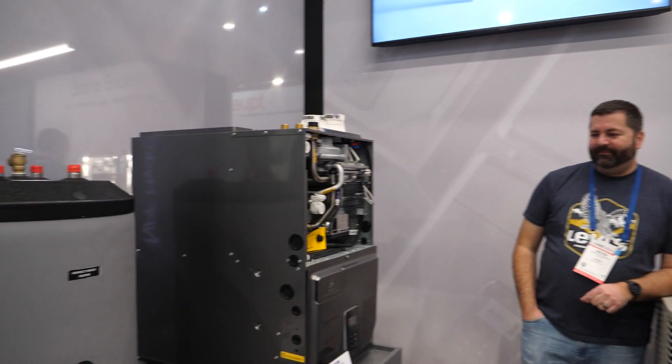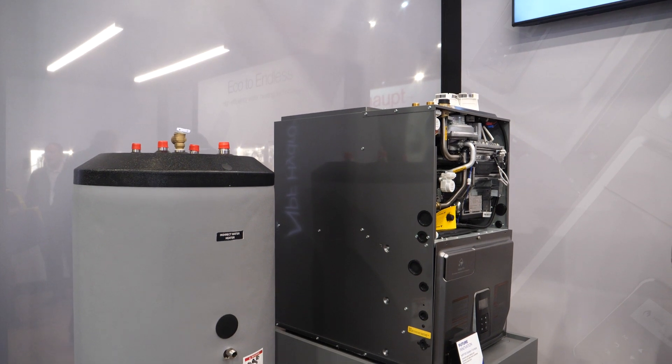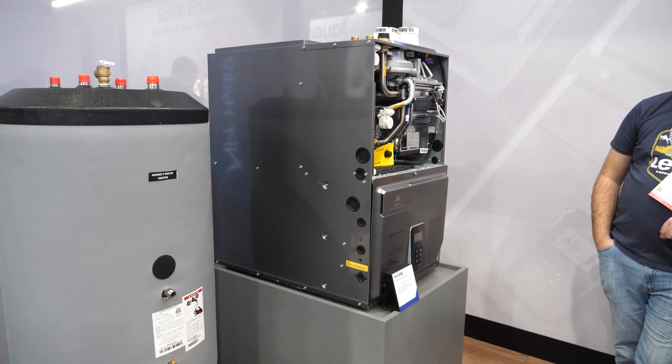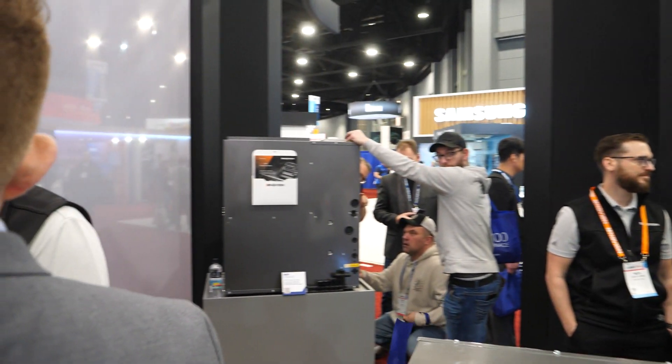The great market for this technology — I have something like this in my own home. The advantage is if you're currently under a rental water heater and have a furnace, you can take both of those things out, put one appliance in, have a much smaller mechanical room footprint, and the reliability of one appliance. This is one of the most comfortable systems because of our turndown ratio capability. Our 60,000 BTU furnace can fire down to 9,000 BTUs; the 100,000 BTU can fire down to 14,000 BTUs. We get a longer run time for more consistent heat. The way we program this is to actually maintain a supply air temperature anywhere from 90 to 150 degrees — so it's not that scorched air feeling like some furnaces.